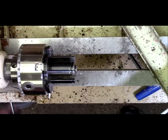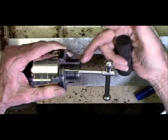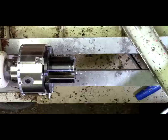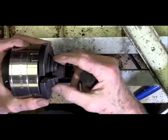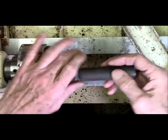Well, okay. I tried to use this chuck here to do it. And what happened was the jaw set flexed on me. So when that jaw set flexed, it came out of the jaws. If you go to the other chuck, here would be my next option, and it doesn't flex, but it puts me close up to the chuck when I'm working on it. One Way, and the large One Way chuck, the jaw set that they have for the jaws that go out also flex. They're light duty and they flex. And when the jaw flexes, it loosens up the piece and the piece will come out.